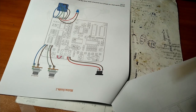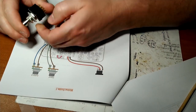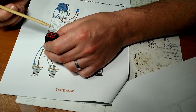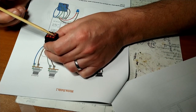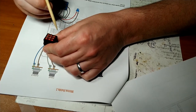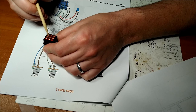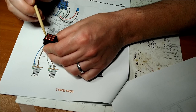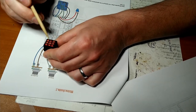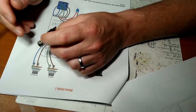So this is double throw. So on, off, or up, down. Triple pole. So the middle one is the common. And when you click once, this common will be connected to the guy on top. Separately, the middle guy connected to the top. Click it again, and then it goes to the bottom. Middle to bottom, separately, middle, bottom, you get it.